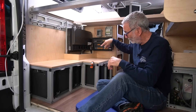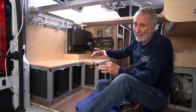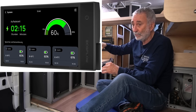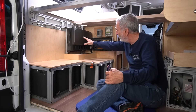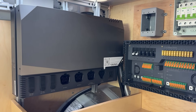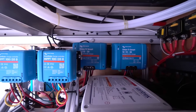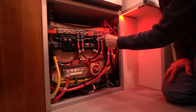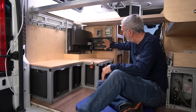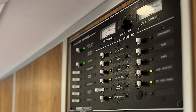The EcoFlow system's main components are installed. This power module takes the place of my bus bars, class T fuses, shutoffs, and breakers — all the big stuff in the physical plant. This module with DC fuses and AC breakers takes the place of my classic yacht-like breaker panel that I'd put in the living space, generally above the fridge.